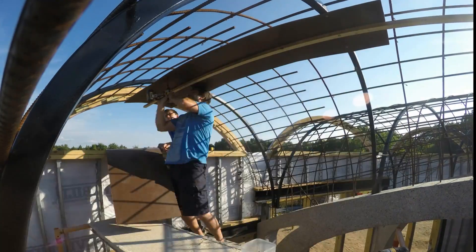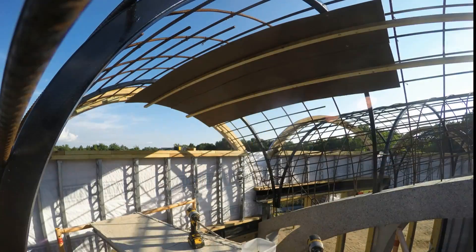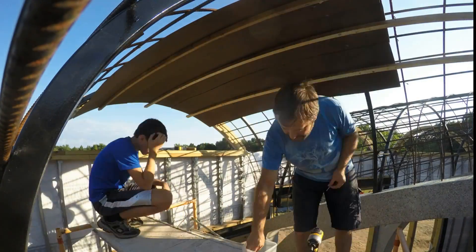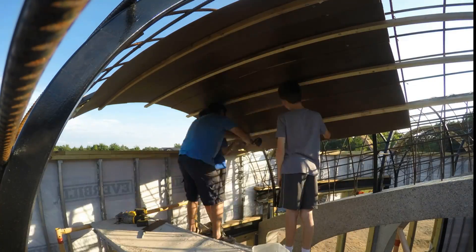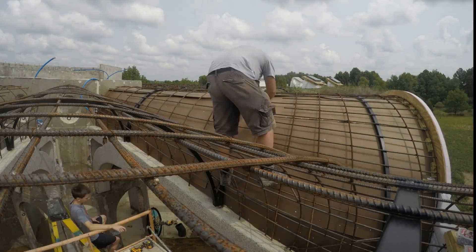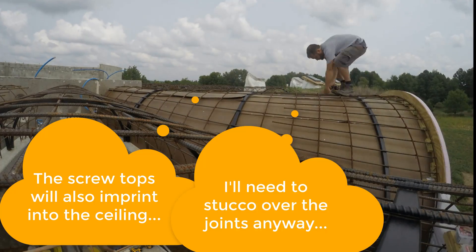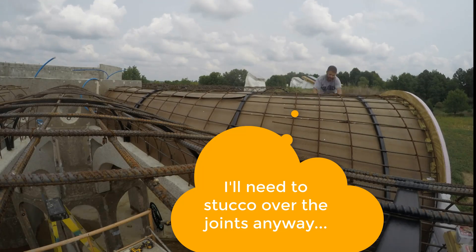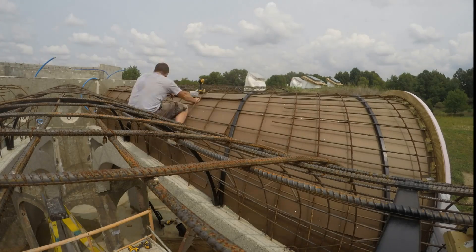These new narrower boards were much more manageable, but were still a bit too floppy until we put that support stick in place. We then put additional sticks to cover the seams between the panels. Skipping ahead, and since I wasn't worrying about butt joints anymore, I also didn't mind putting the screws in on the outside. This pushed the hardboard securely against the wood battens, and you can see how it really tightened everything up.